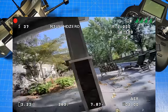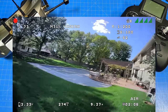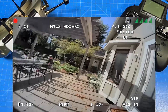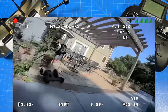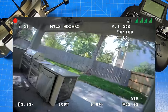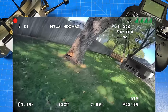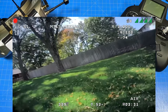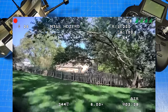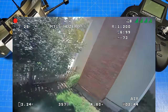I wanted to make sure I did the outside flight because not everybody flies these inside. In the outside flight you can see that battery sag isn't nearly as predominant as it was inside, outside of punch-outs. The PID tune on this — while it's fine for general flying — when you do the punches and recoveries there's a little bit of a shudder. I think we need some additional PID tuning or maybe just TPA adjustment, especially on that 100% throttle punch-out. The dive testing showed we didn't wash out, which is a good sign for the powertrain.